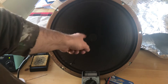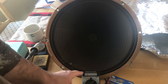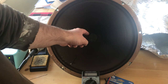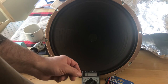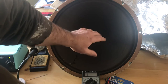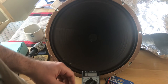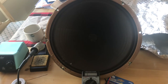I'm not hopeful this will work, but we'll give it a whirl. If we see some resistance or success, great — if not, I'm going to have to take off the dust cone and see if I can make a repair from there. If not, see if I can pull out the old voice coil and paper former and put a new one in and mate it to this old paper cone — or maybe it's going to need all new parts when it's all said and done. But let's try this and see if it works.